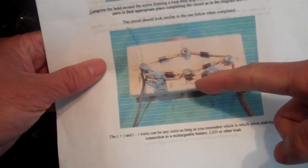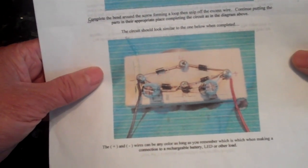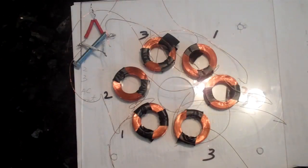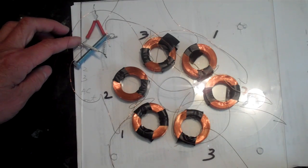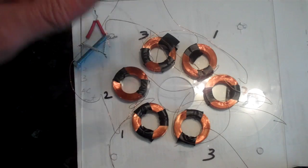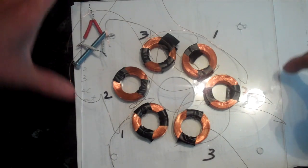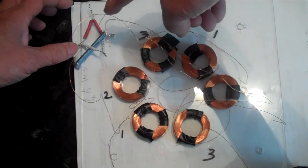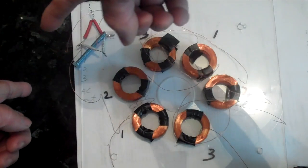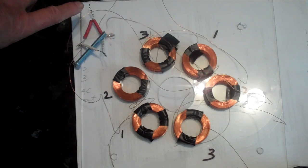This circuit here — where the capacitors would double the voltage output from your alternator — I have a mini gen and I use this circuitry to increase the voltage of the alternator, so I was thinking of doing the same thing with this axial flux alternator. Basically it will be like three separate phases: the AC from one A and one B would go to one rectifier, two A and two B to another one, and three A and three B to another one.